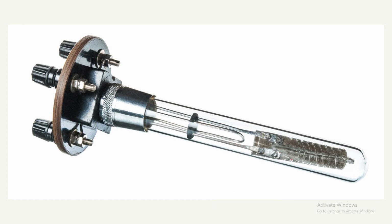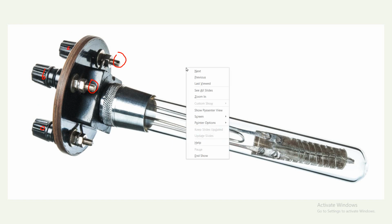You can see here that they are connecting to this platinum wire, which is wound around the mica. Then the dummy leads, they're just being short-circuited. They just go back, like that. So we are going to have 4 terminals. They are represented here. The connections can be made from this side, behind. So it's that easy.